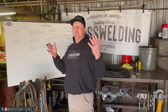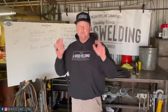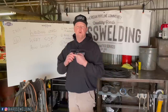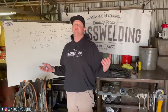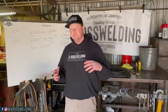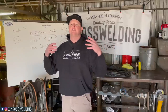I'll start off by sharing what I use on my welding machine, and then I'll pull up a couple of charts so you can see the proper way to pick out your proper size of welding lead. First of all, how long does welding lead last you? It depends on what type of welding you're doing and how much of it you're doing, but it also depends on how you take care of your welding lead — the way you store it, whether you park in a garage or not, whether you have lead covers, whether the sun's hitting them a lot, whether you're working on gravel and stepping on your leads.